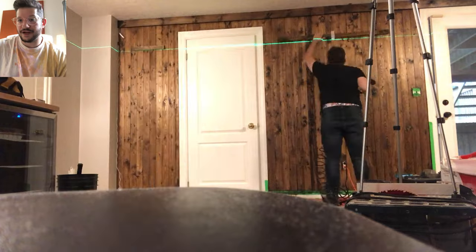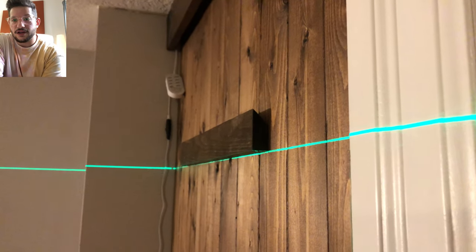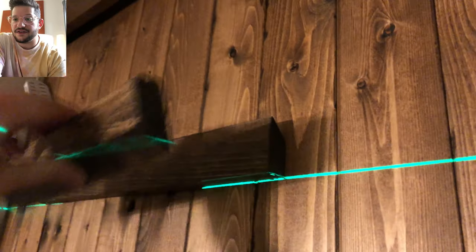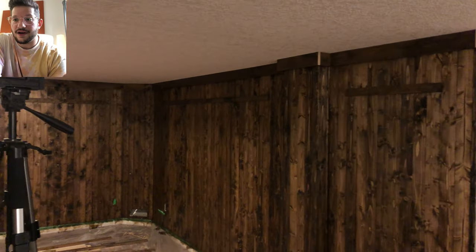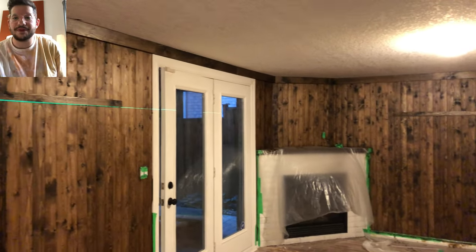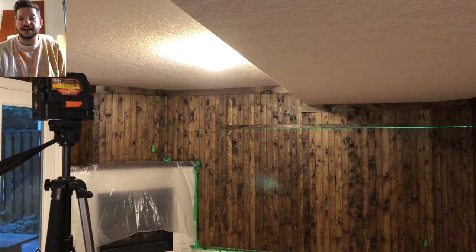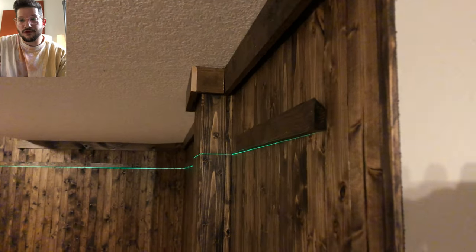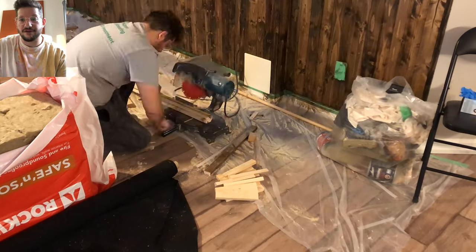Now we can get into adding the French cleat, which is how we're going to mount these panels around the room. A French cleat is essentially a 45-degree angle cut in opposite directions. We used the same 1x4 wood we used for our lighting trim, cut in half on a 45-degree angle on the table saw. The 45-degree angle is nailed into the wall, and the opposite side of the angle nails into the rear of the panel — that's how the panels mount into this track. This was a cool detail for this client: I wanted these panels to be movable and easily removed to give the client modularity in his live room sound. As the band records, they can add more panels for a more dead sound, or take panels off and slide them around the track for a livelier sound.